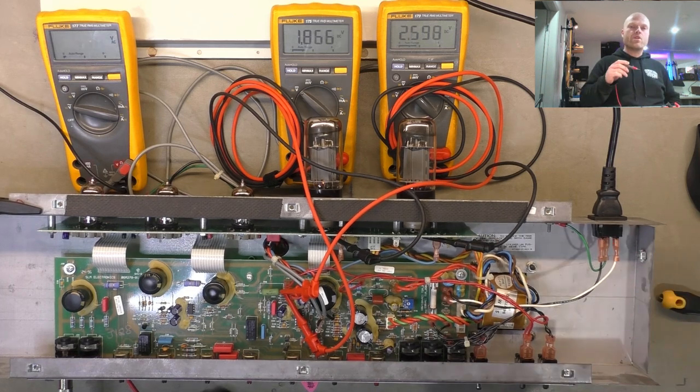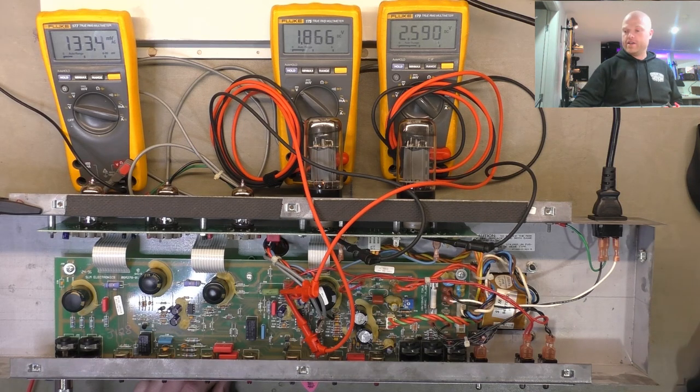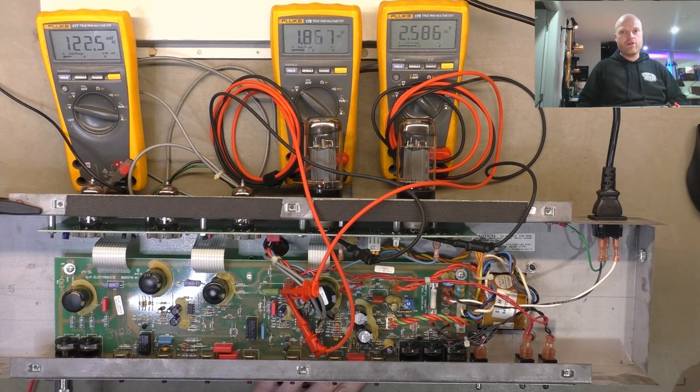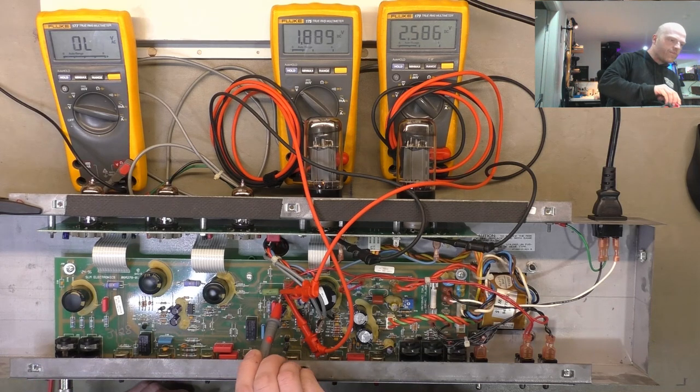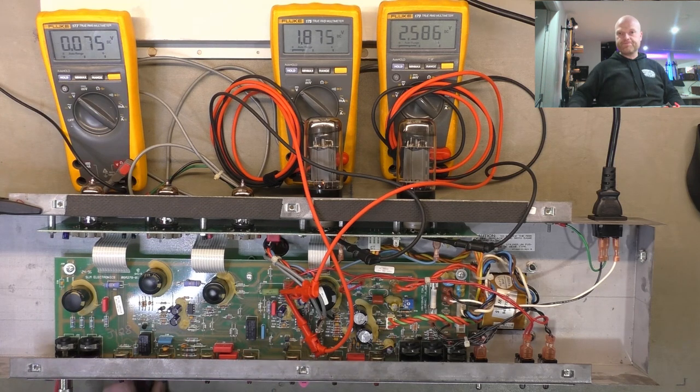So that's the reality of the modern electrical network. Often the voltages overshoot. Some areas they are on the verge of brownout. Here they tend to be high pretty much all the time. So taking that into account, and plate voltage of, what was it, 430? I'll check the ripple while we're there. 1.4 volts on the B plus, that's very low. 430 volts DC, so that's what we'll factor in.